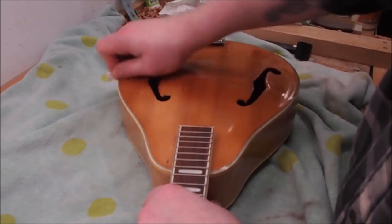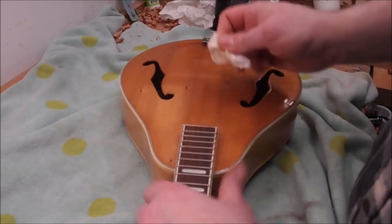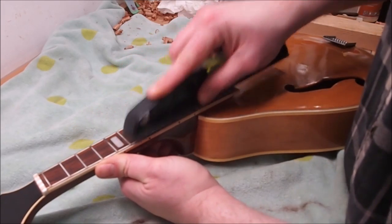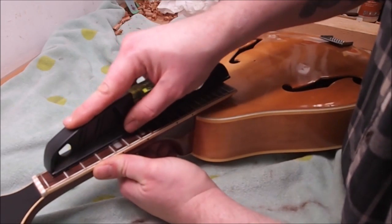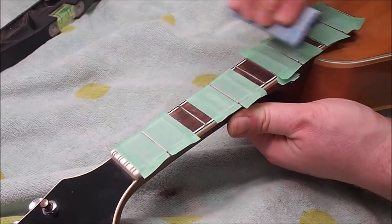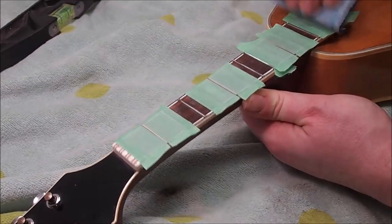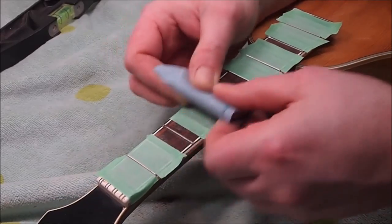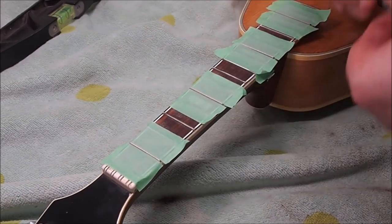I'm using some very fine auto body polishing compound on this thing — virtually every guitar made in the 70s has a rather fragrant and disgusting coating of nicotine on it. Just a quick little fret level, and it's hard to crown frets that are this narrow, so what I'm doing is basically what Gibson used to do — just knock off the corners with some sandpaper on a flat block. I'll do this with 400, then 600, and a little micro mesh and we'll be ready to go.